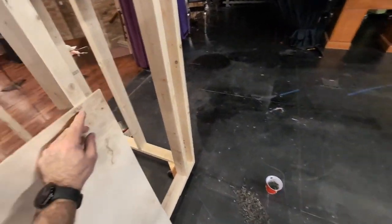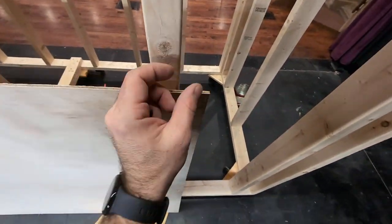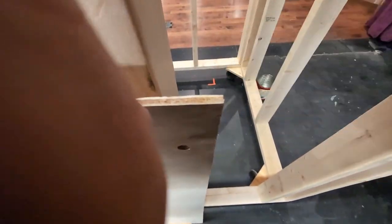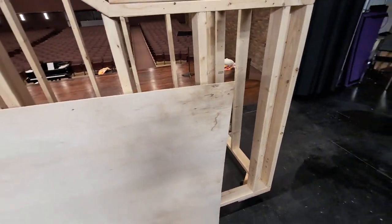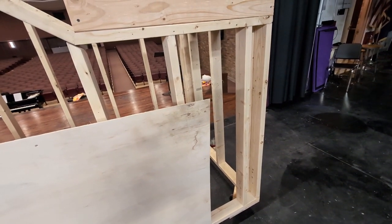So a full 8-foot sheet is going to work out, bam, right on top of, sorry, where the stud should be. It'll fully eclipse it, and then the next sheet won't have anything to grab. Sorry, on this side, it won't have anything. So we either cut the sheet 3/4 of an inch short before we put too many more screws in it. That's probably what we should do.